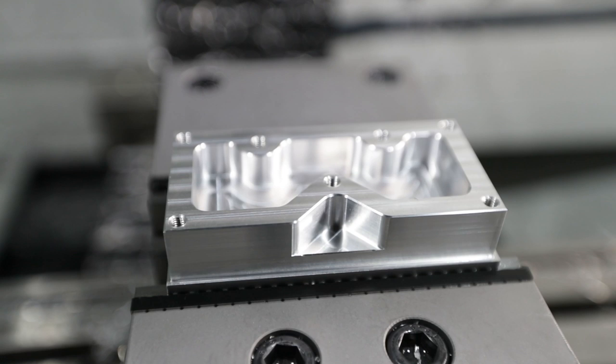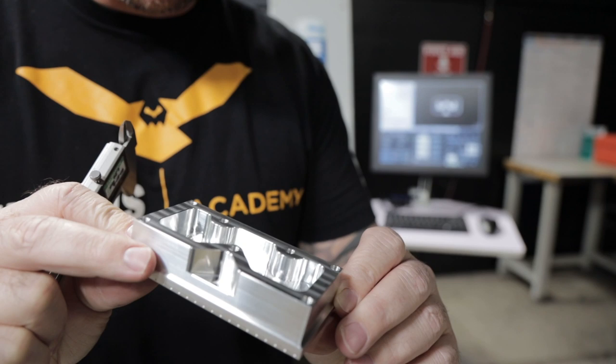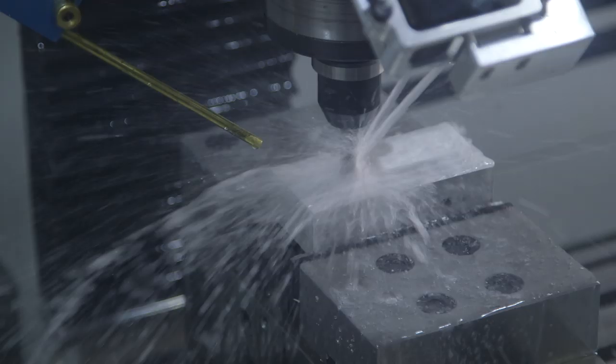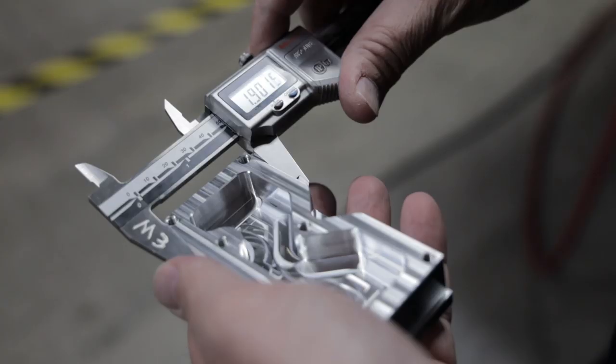Let's go check out the part we just made. And there you have it — the Titan 1M. Oh, it looks pretty. One thing I'll say is that on this part I didn't have a face mill that fit this machine, so I just need to go get a little two-inch face mill we can run with the right tooling. But we wanted to get after it today because the machine's on the floor. We took the three-eighths end mill, went around, came across the top. Part looks absolutely beautiful. I haven't made any adjustments — pretty much 1.9 on the money.